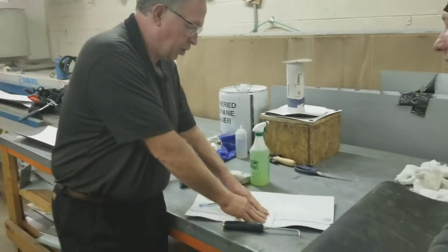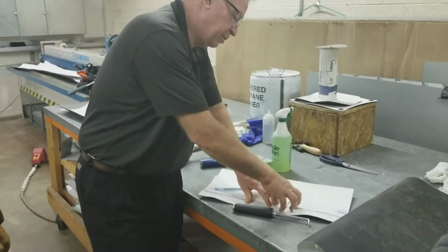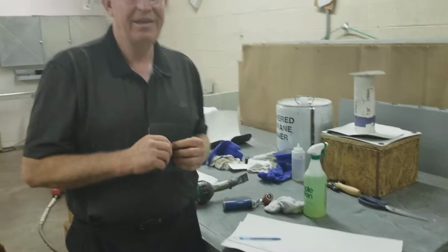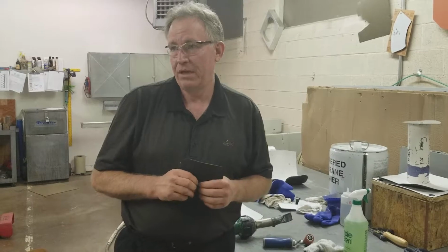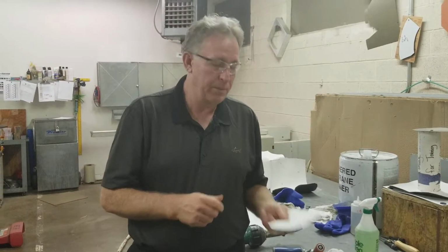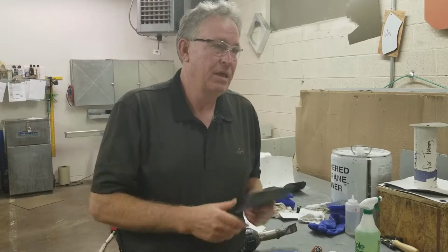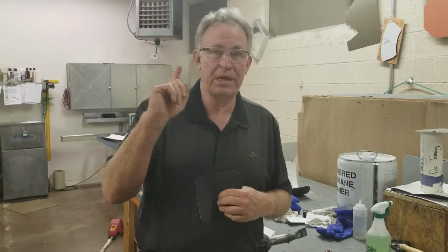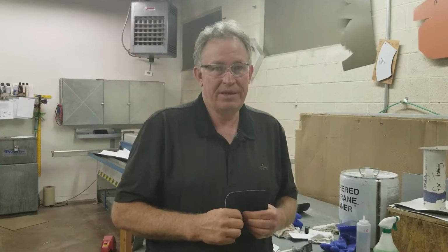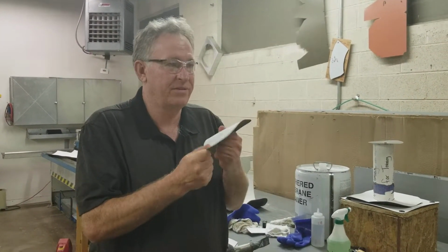So if this is a target patch or a seam crossing it, that's fine, but you have to put a T-joint patch on that. And that rule for Versico applies to 60 mil membrane, not 45 mil. So if this is 45 mil membrane, you can put that on there and not have to put a T-joint on there. But again, at Frontier Roofing Systems, we are just going to patch every T-joint, whether it's 45 or 60 mil. And in fact, we've only put on one 45 mil roof because it's not a very costly upgrade, and it's a way better sheet just because it's thicker.